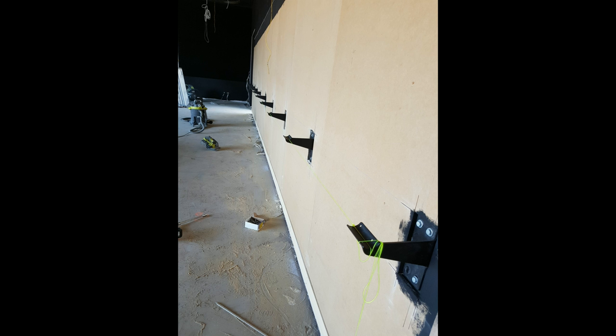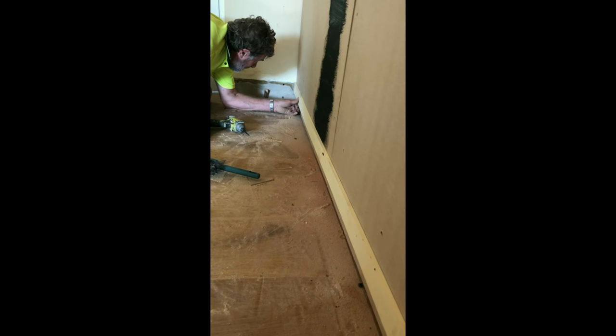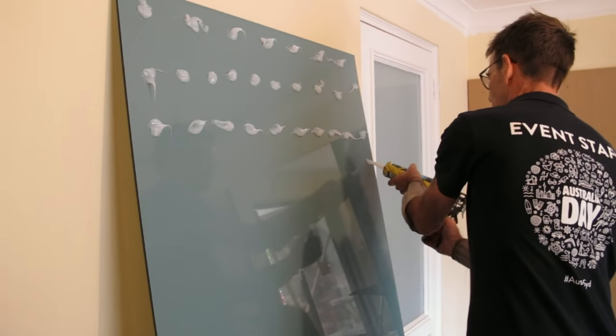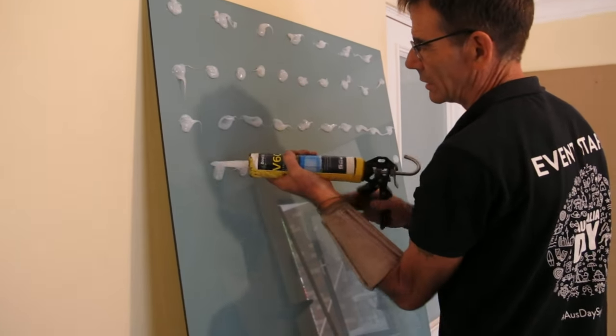The vertical joins can subsequently be painted black and a 90x9mm skirting applied 5–10mm clear of the floor and perfectly level. Neutral clear silicone is applied to the mirror with enough volume to fully cover the mirror back when pressed into place.